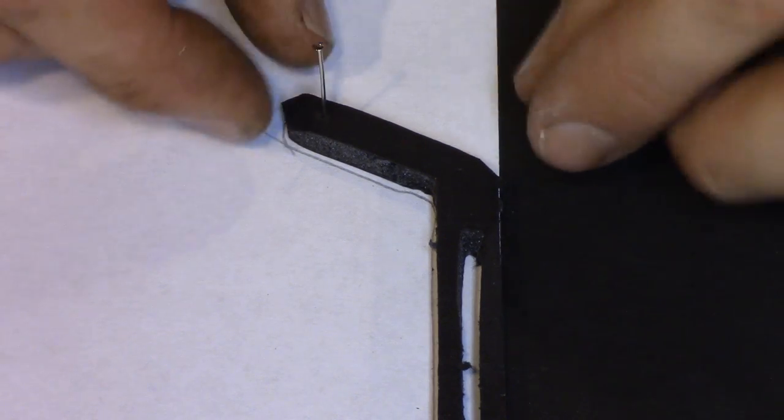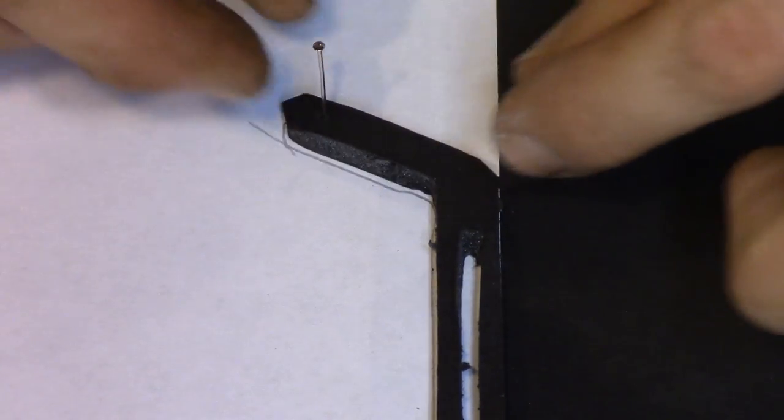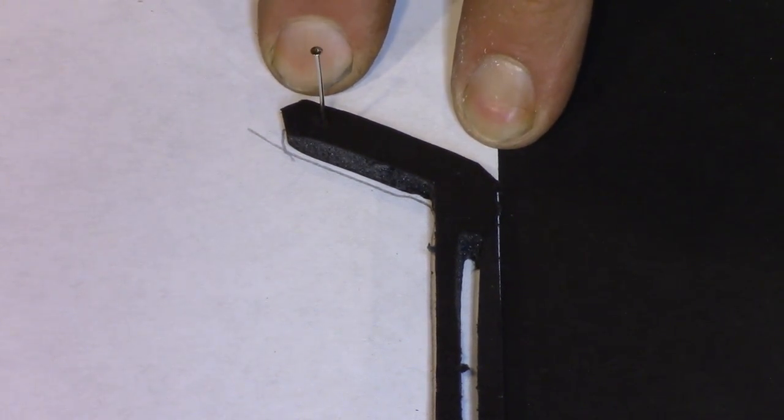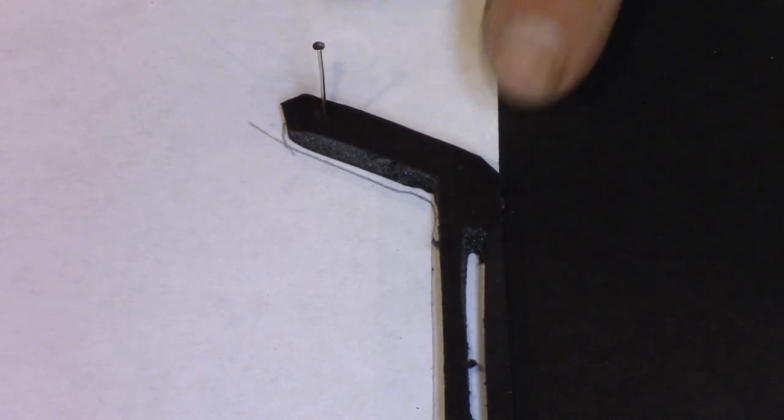So I'll copy that section, and then instead of drilling them all separately, I'll stack up all four and drill it together. That way all the holes are in the same spot compared to each other, like the distance between them. You know what I'm saying?